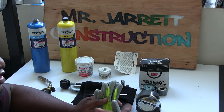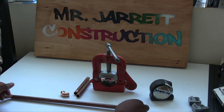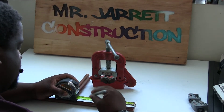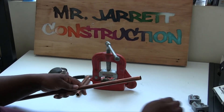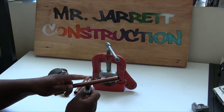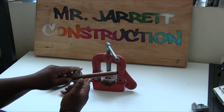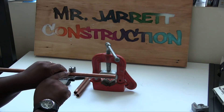Next I'm going to set up everything so you can actually see these tools in use. First thing you want to do: we want to get our half-inch copper pipe — this is our copper pipe right here. Next step, we're going to get our tape measure and measure six inches. We see our mark right here at six inches. We want to open up our pipe cutter and sit this copper pipe on the wheels right here, making sure it lines up directly with the cutting wheel.